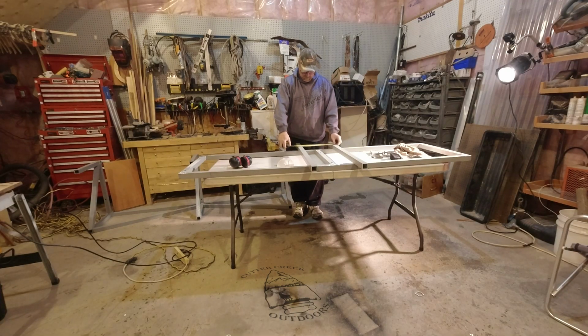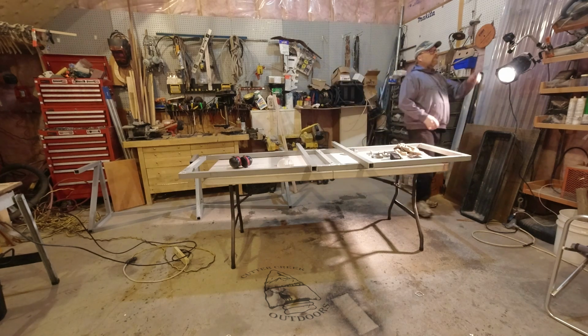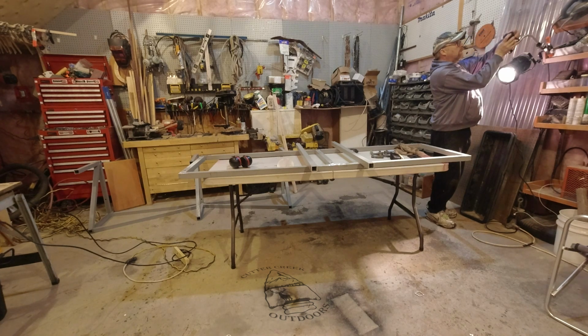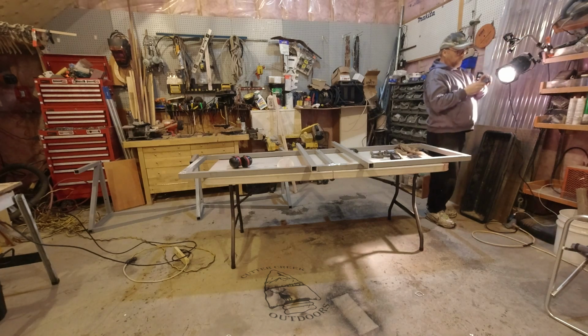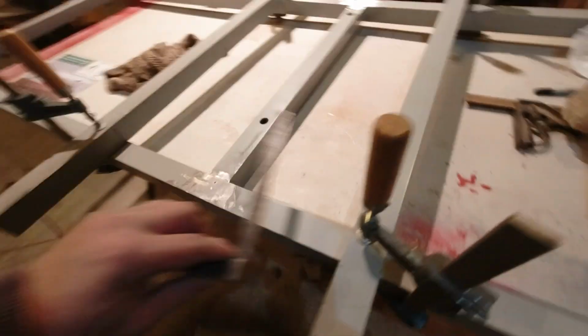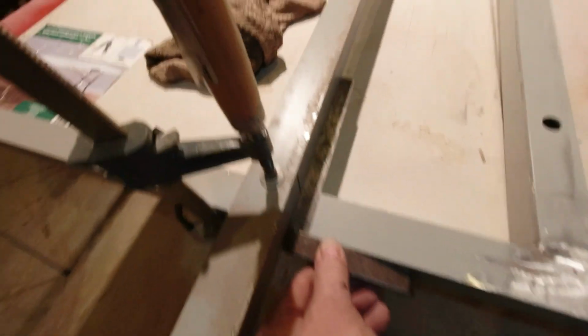So now that I have the pieces cut, I want to assemble them kind of like a Lego or Meccano set, where I can actually set them up, clamp them together, and then decide if they're going to work like that in the real world. Because sometimes from the drawing, it looks great. But once you get it in the real world, you're like, okay, this thing won't fit, or you can't get this on or off because this is in the way. So I just put them together like this, square them off, clamp it all down, and then I decide if the skis will fit, if I need it to be bigger or smaller. It just makes more sense for me to visually see it in the real world as opposed to on paper. Paper certainly gets me started, gets me some measurements, gets me costs and ideas, but this is the best way for me to visualize, actually do it.